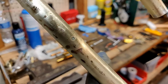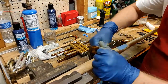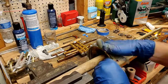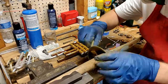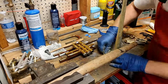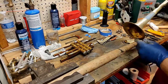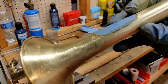I will be removing most of these dents but some require other special tools that I don't have at the moment. Now I move my attention to the bell throat and bell flare just to make sure that I get a clear picture of where those dents are, as well as applying this kind of satin finish that we're going for. This is the first layer of the scratch pass, so I take the time to make sure all of the scratch lines are moving in the same direction. I pay special attention to really close to the bell wire because this area is easily overlooked and a tight spot to get the sandpaper into. As you can see the overall finish is much more aesthetically pleasing and this is just the first step — it will get better.